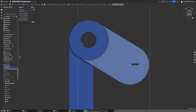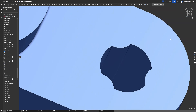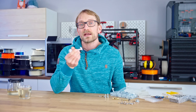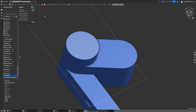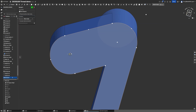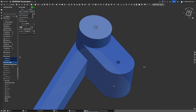Here's how to add these to your parts. You could model these from scratch every time you want to use them, but it's much simpler to model the negative space — the cutout — just once, and then import that into the thing you're currently working on. I did these in Onshape, but the idea is the same in Fusion. Once you're ready to add the self-forming thread features to your actual part, you create the reference points where you want them, then use the derive feature to import the geometry to your workspace. Onshape uses mate connectors as references, and I found they snap to your target points best if you create a small hole first instead of just using a sketch point.